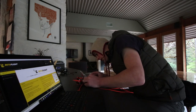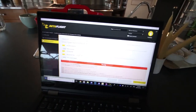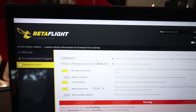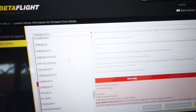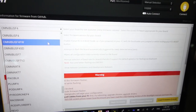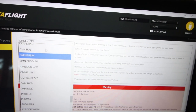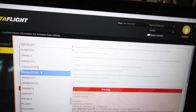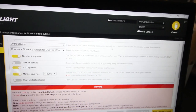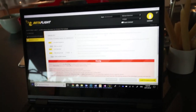This is where I got stuck. You want to plug in your board and have it reading. In Betaflight, you want to select Omnibus F4 SD — that's the one you need for the V3 Pro. I was selecting plain Omnibus F4 and not this one. Once you select Omnibus F4 SD, that's the fix — that's what got everything working for me.